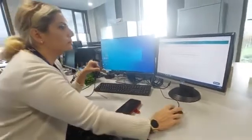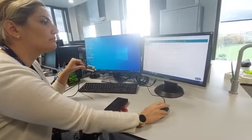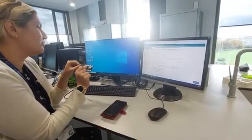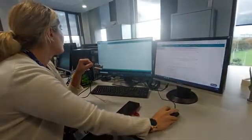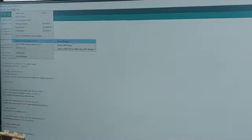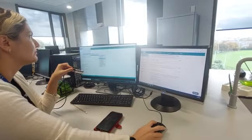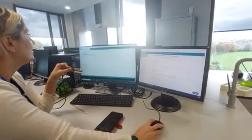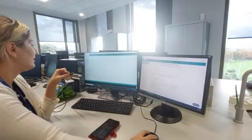A few things to be careful about: the installation of the Nano 33 IoT board is a little difficult, so be patient. Install it using the board manager from the menu under Tools. You click on the name and end up with this board — it comes as a separate category — and then you can select the Nano 33 IoT. Once you have that selected properly, the port should recognize it.